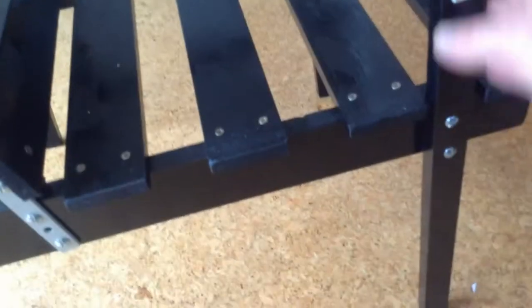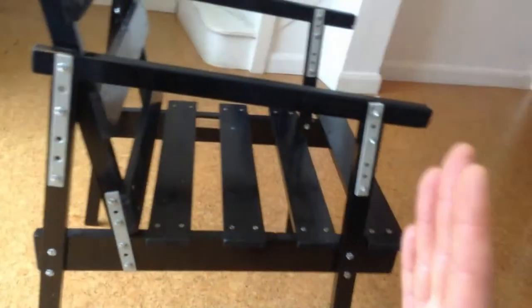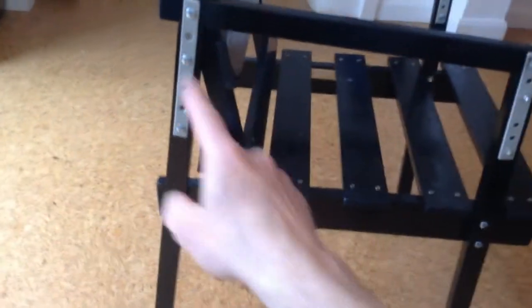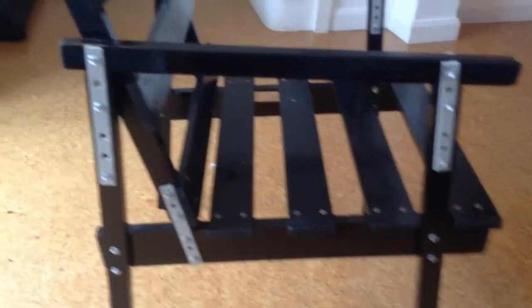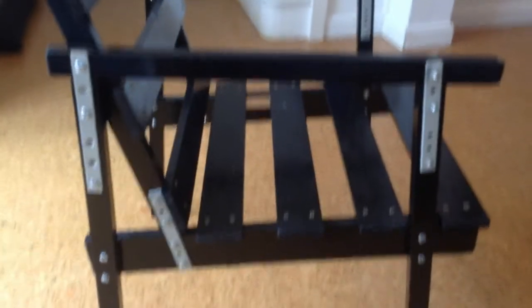So where the legs are splayed, they are partly acting like columns, but they're partly acting like buttresses. And so they're mostly columns because they're mostly straight, but they're slightly tilted, which makes this triangle bigger, and it gives this more of an angle. It gives it a diagonal, a triangulation that increases the strength.